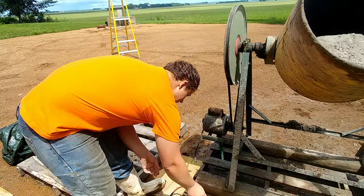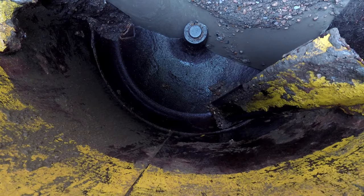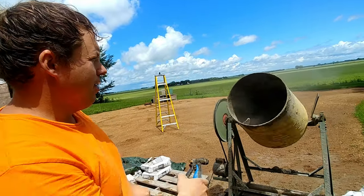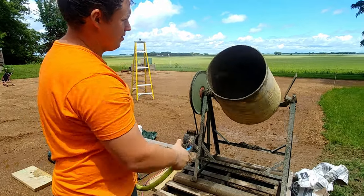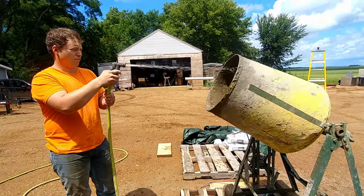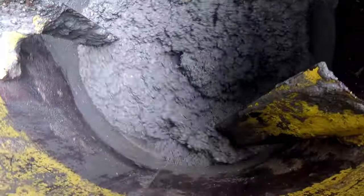With this particular model, once you plug it in, it doesn't start automatically — you have to start it manually. You're going to want to have a garden hose ready to go and I can just kind of pull it in like that. I usually give it a minute here, so I'm just going to spray it along the top edge straight down into the back. Now just keep adding water incrementally, little by little, paying close attention to the consistency. You'll want the cement to be as thick as possible while still being easy to work with. The cement gets significantly weaker if you add too much water, so the consistency should be about that of thick oatmeal.